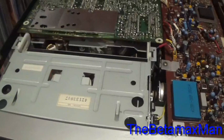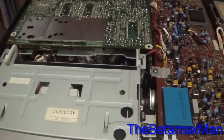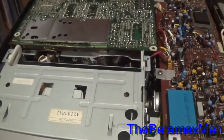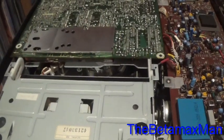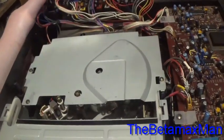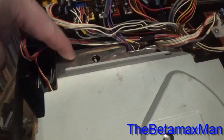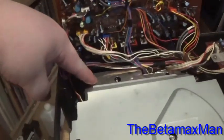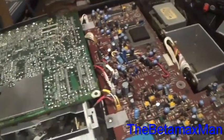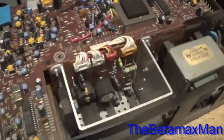These particular models have a lot of problems where the machine is recording in black and white, so that should fix it. You can also benefit from doing a recap on the head amplifier. The head amplifier is right here underneath this shielding plate — your head amp is here and your preamp is always right here. Those are the two areas. As far as the transformer goes, I think you might have a regulator that is going bad.